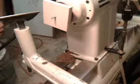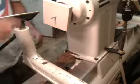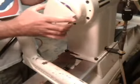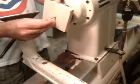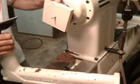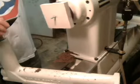Okay, so we're back this morning with part 2 of the homemade screw chuck. What I did yesterday was grab a block of wood, counterbore a hole in the back side of the block, deep enough to accept the head of a lag screw. It's a 1/4 inch lag screw, I think, or maybe 3/16. Epoxied it in, had to let it set overnight so it was cured fully.